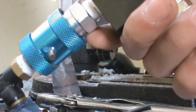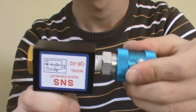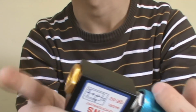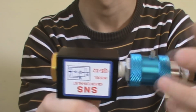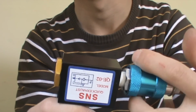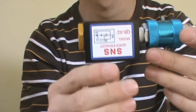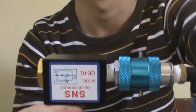That's done. Now if you shoot this again, it will only have one bang each time, because the charging won't push the piston to the front and there won't be air wasting out from the exhaust port. See, it's only the little waste that you get here when you reconnect the air source. Basically you're done. Next, I'm going to teach you how to make a blowforward bolt.